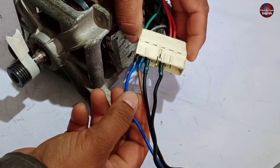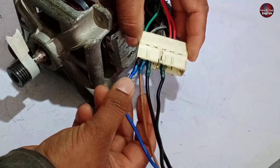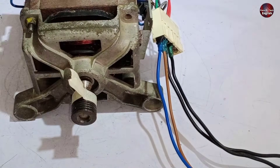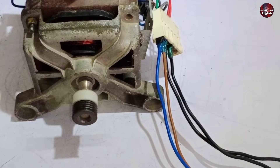If you make these connections, the motor will still rotate clockwise. Connect a jumper wire with terminals 5 and 8, and line and neutral wires with terminals 9 and 10. It still rotates clockwise.